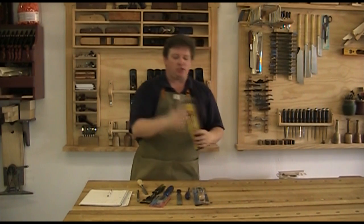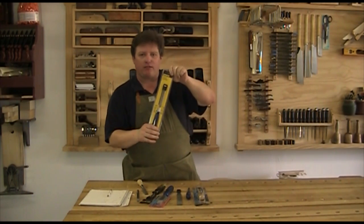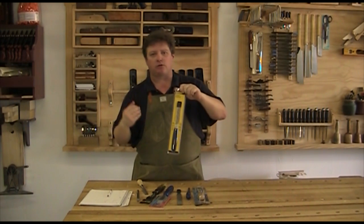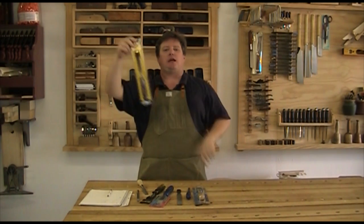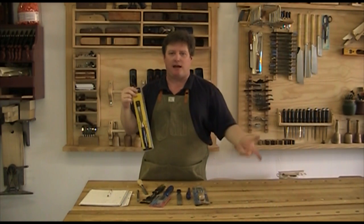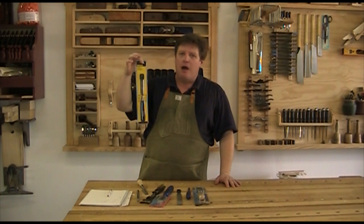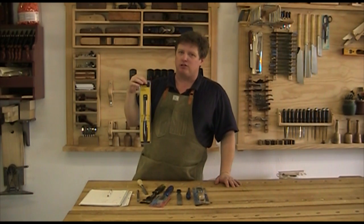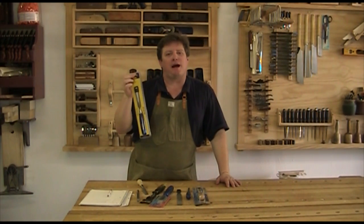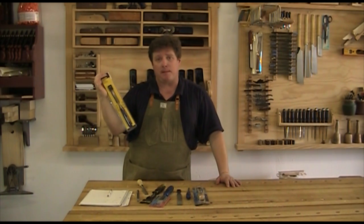You put a chisel in a package, you want to batch out a trillion of these at one time for the production run for efficiencies, and then just leave them in storage for 5 or 10 years and sell them as you pull them out and sell them as you need them. Well, if it's sitting in the package turning black because of oxidation of the O1 tool steel, it'll be worth less money once it hits the showroom if it's sitting next to a nice shiny one. That's just how people are.